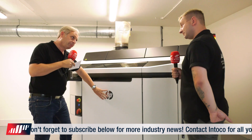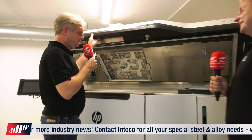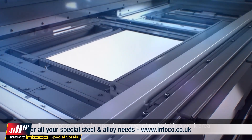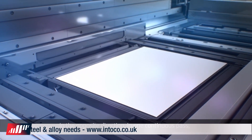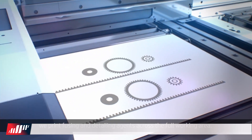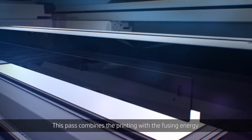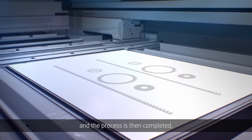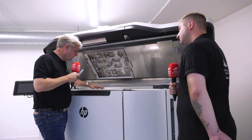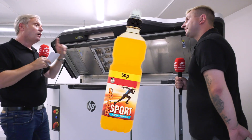You build your unit into the working envelope — lots of powder. The powder comes from a roller, then the unit comes across, and you've got your fusing agent which will then go onto the material, heating it up to about 160 degrees C. The fusing agent is black, so it doesn't need to be as hot as other processes, and then it'll build up layer by layer by layer. The build envelope is 380 by 290 by 380, so a big working envelope.